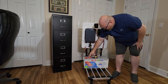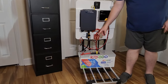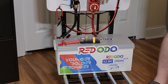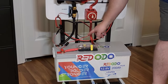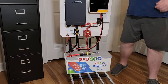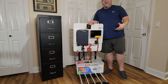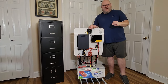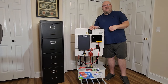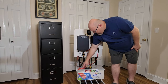As far as the wiring goes, that's from a company called New Concepts — it is a 1/0 AWG wire and I used it for all the major heavier thick wires. The reason I use that is because it is oxygen-free copper wire and it has over 5,140 strands of copper wire per wire, so it's very flexible.